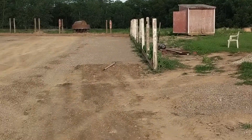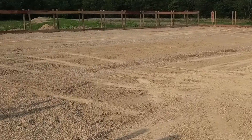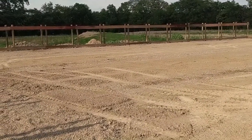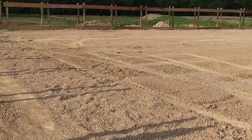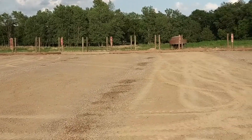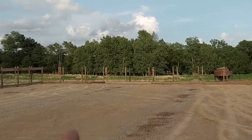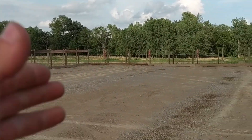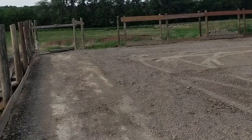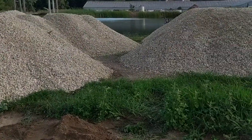Update on the horse arena project. Me and my brother just went over it with the transit — we use an old transit, you have to have two people, it has a stick and a scope. We went over this whole thing, five rows and four tile, going down the middle of each one. Every row is about within an inch of what I'm wanting, so I figure that's good enough because I'll have all that limestone to put on.